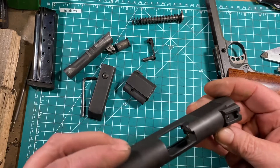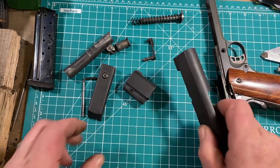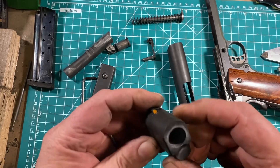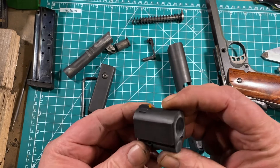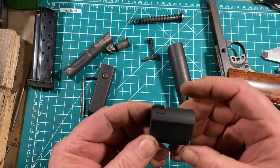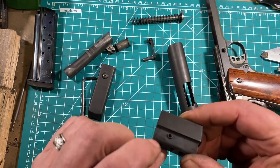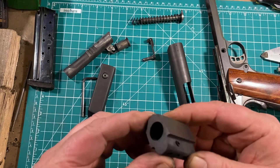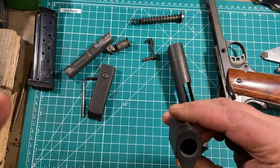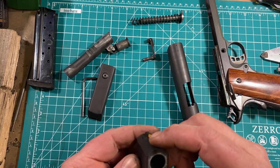The slide is fitted with a Novak non-adjustable rear sight and the Novak front sight. This weight is steel — I tried the first one in aluminum, it worked poorly and wasn't heavy enough. So I made one out of steel, and it did not sit straight in the gun, so I inserted a set screw to hold it in position. Eventually, in the interest of craftsmanship, I'm going to have to replace this with one that fits better, but for now it will do.